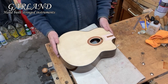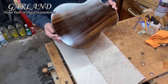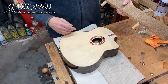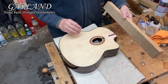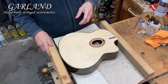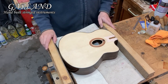Here's a quick tool or fixture you can make. Sometimes you need to hold a guitar body for light operations like sanding, grain filling on the back, or French polishing, and you don't want to get out the full cradle. So I've made these beams lined with crubber — a combination of cork and rubber — and the dowels just fit in the dog holes. I can tighten the vice up lightly and it holds it steady enough for that kind of operation. Very quick and easy.